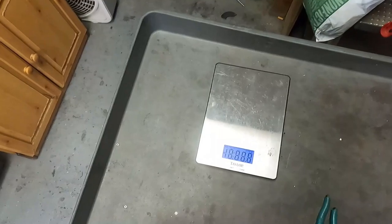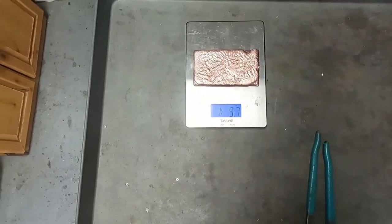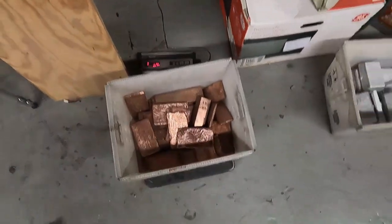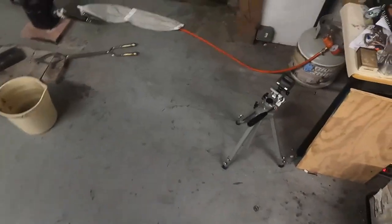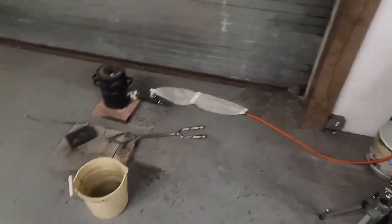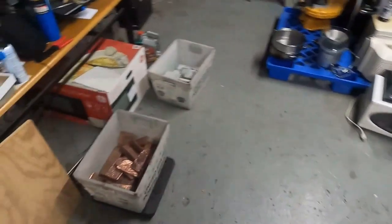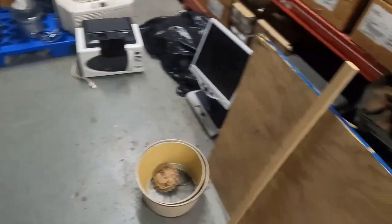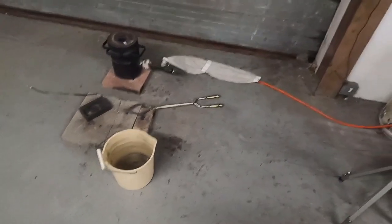All right guys, the bar's all cleaned up. We had one pound 9.6 ounces after stripping the wire — let's see what we ended up with: one pound 9.7 ounces. So there might have been a drop of copper left in the crucible from the last melt. We didn't lose anything off of that stripped wire, which I anticipated. Let's add this to the stack — stack's looking pretty good. Thank you very much for watching. If this is the kind of stuff that interests you, please consider hitting that subscribe button and the bell notification. That's pretty much what you can expect from my channel: scrapping things down, taking the copper, melting it down, and adding to the stack. Thank you very much for watching, and happy scrapping, casting, and stacking.